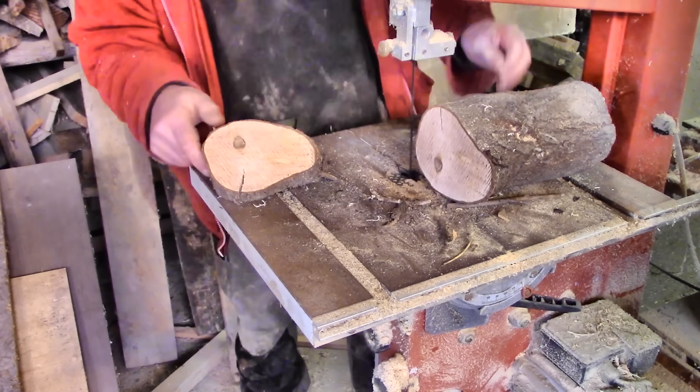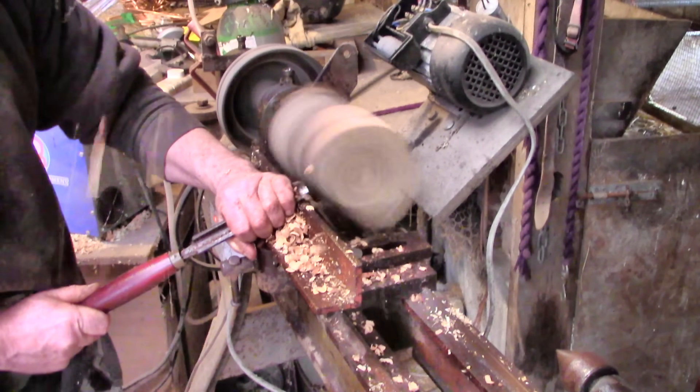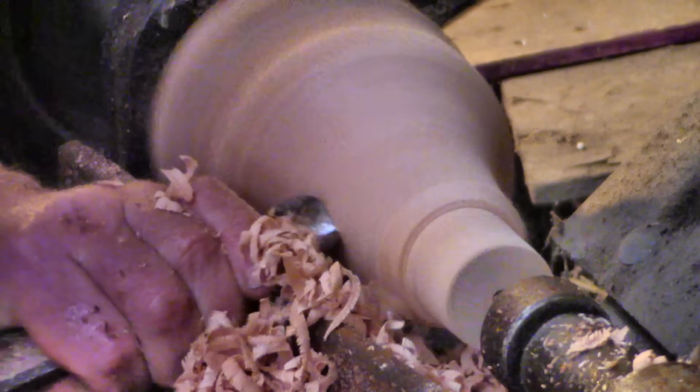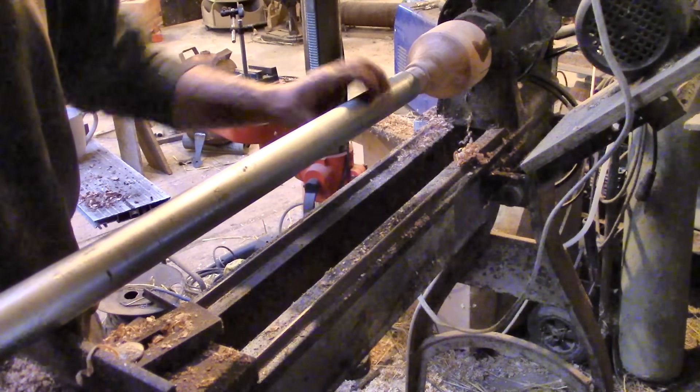Back to my boiler — I'm trying to squeeze a 25-meter coil of copper plumbing tube into the chimney. The chimney is bound to get hot and the plan is that some of the heat will transfer to the tube and then into the water. I'm hoping to use this convected heat because it's easier. The problem was that the thin copper tube just wanted to kink instead of rolling into a neat circle, so I just couldn't make nice spirals. I started off bundling it up as best I could, but decided that was too messy.